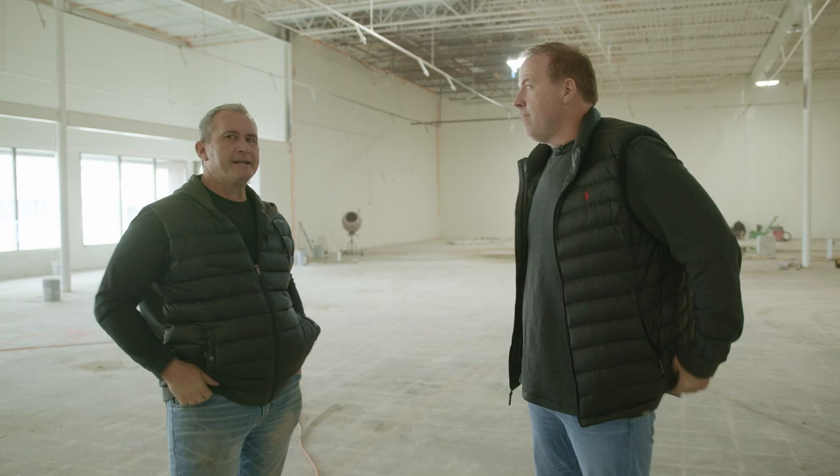Almost. Yeah, it was a little bit of an undertaking. We ended up having to replace the roof. And part of redoing the roof, we had to redo the metal and all the insulation in between the metal and the TPO. And we went with an R30, which is eight and a half inches thick of insulation.